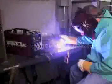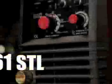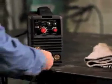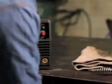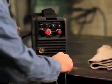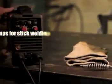The 161S is available in two standard packages: a stick welding package and a combination stick TIG welding package. Each package includes everything you need to begin welding right out of the box. The ThermalArc 161STL Portable DC Welder is designed to provide increased control and superior arc performance for tackling more demanding DC stick and lift TIG welding jobs. It's capable of delivering 125A on standard 115V circuits for stick welding and 160A for TIG. When used on 230V circuits, maximum output is 160A for either welding process.